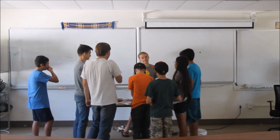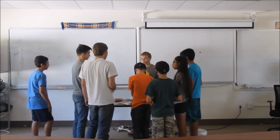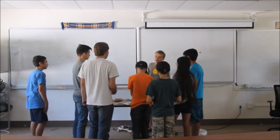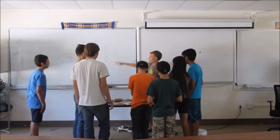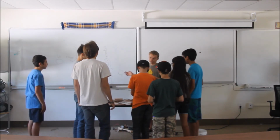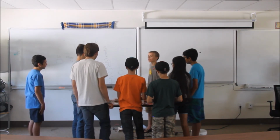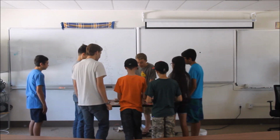Pretty much. But there's easier ways. Resistors are not a very efficient way to step down voltage. I mean, it'll work to get a voltage right here, but if you do that, then it's going to waste a lot of power because there's always going to be current flowing through and not your circuit. So that just wastes power. And I'll explain watts in just a second, because watts is how much power.